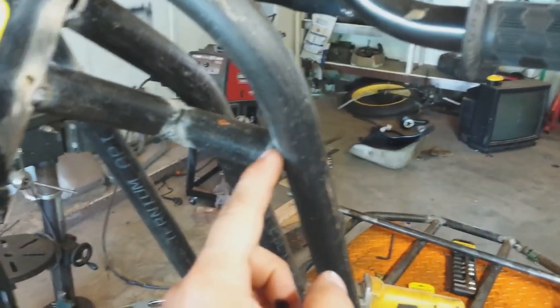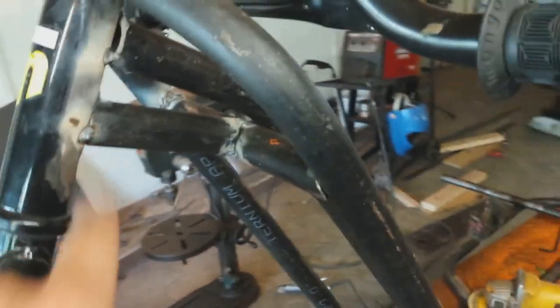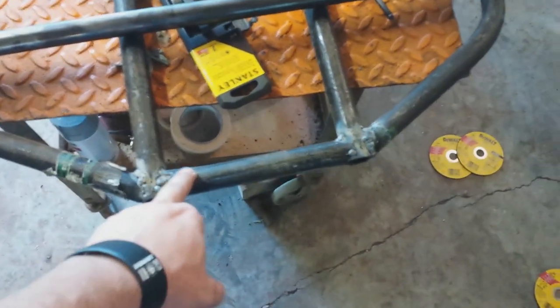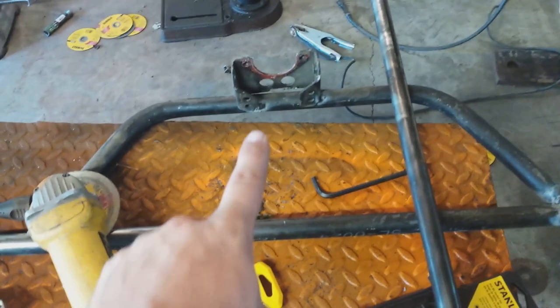After I got this tack welded on there, I realized I needed a little bit more support. So with my cross brace going across, I added another piece from here going up to the bottom. I then got the frame coming down and it kicks to the back and goes all the way around. I added another piece on the back side. Then off of here, I bent another piece 15 or 30 degrees, then it kicks straight, another 30 degree bend, and comes back up here. I've done it on both sides. That's where my axle supports will go. I will take these ones off.